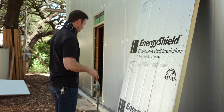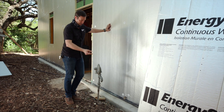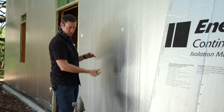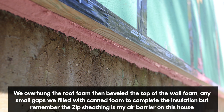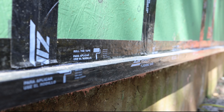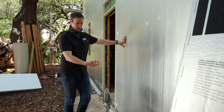A couple of things I want to show you on the details. At the base of the wall, we didn't want that foam just hanging out on the bottom. We did a detail that Steve Basic, my architect friend up in Boston, helped me develop — you use a two-by-two, basically a rip of two-by-four at the thickness of the foam, so it's inch-and-a-half by two inches thick. We screw that into the base plate of the house all the way around. We're using zip sheathing as our water and air barrier, so we put a piece of big zip tape — six-inch tape — up the zip sheathing, over top of the two-by-two, and down the face, so I don't have to worry about bugs or insects coming up and I've got protection at the base of that insulation.